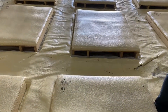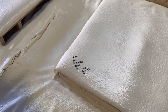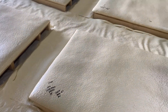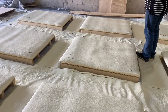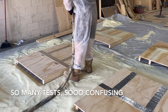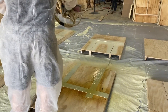From a different angle here - the panels have been sprayed and certified by the inspection agency doing the pre-testing. They want to know the R-value, what chemistry it is, how the deck is put together, and what class we're trying to get these tested for. These will get packed up and shipped off to a facility that will do the testing, and we'll know the results within the next few weeks. We're flashing in these seams - you'll see these panels have some tape on them just to fill in the seams.